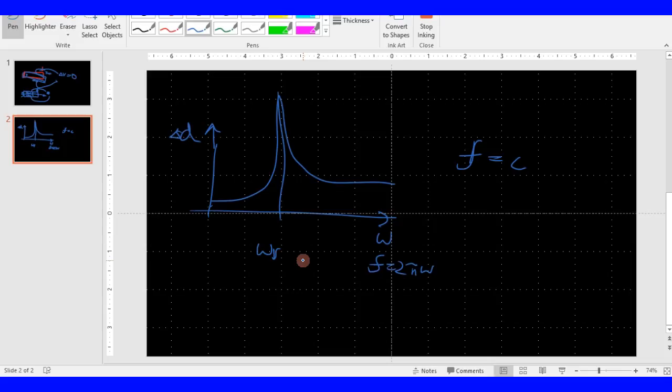Depending on the design of your piezoelectric energy harvester, you will typically operate under the resonance frequency, because usually in mechanical systems it's hard to get your system to resonate exactly at the resonance frequency. Therefore, we usually try to design the resonance frequency to be higher than the vibration that we're trying to capture, so it can ensure that any variation that we get in the frequency spectrum can also be absorbed. Because once you go higher than the resonance frequency, you start to absorb less energy.